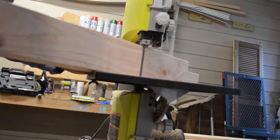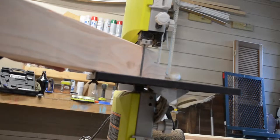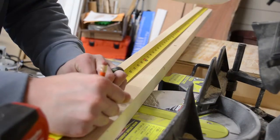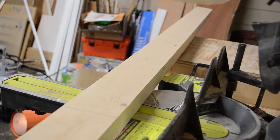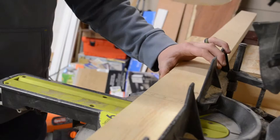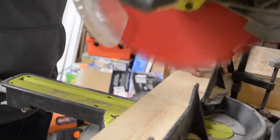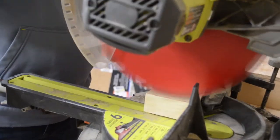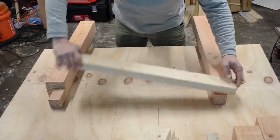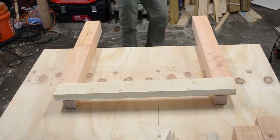Here's a true tip I picked up somewhere: very lightly and slowly run the wood backwards through the bandsaw, hitting the blade at a little more than a 45-degree angle. The slower you move, the more cuts; the faster you move, the less cuts. After trimming the rest of the aprons to the same length, they also got run at that backward angle on the bandsaw to keep the sawmill effect going.